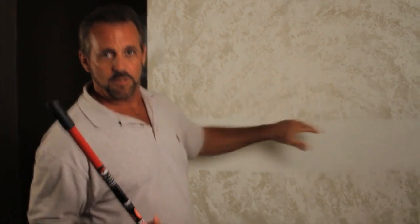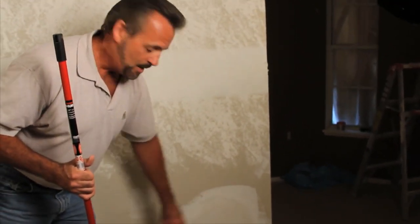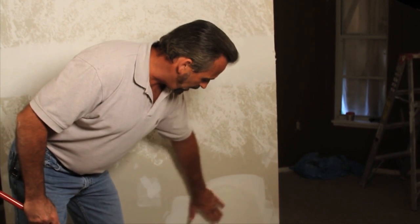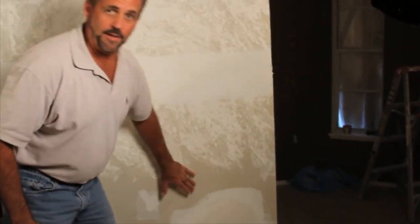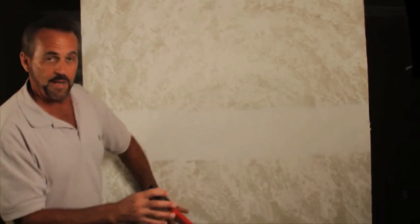Now we're going to go back to the board that we textured earlier — the drywall mud's dried. Down here is that hole where the sledgehammer went through the wall, and this is the hole that we patched. Normally you'd let that dry and sand down any lines to make it smooth. But we're going to show you how this texture can go right over this area and you won't even see those lines. We ended right here and right here — this section is dry. We're going to texture up here and down here, and it will blend in with the existing texture. So you can stop and start in any room, on any ceiling or wall, and pick it back up and get it to blend right in.